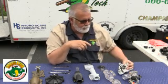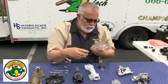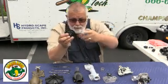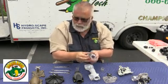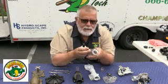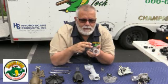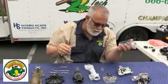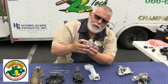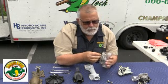Here's the clear body with the diaphragm. The solenoid normally goes here, the bonnet goes on, and this is the diaphragm with the little teeny hole right here. This diaphragm flips right inside. I'm normally going to use some O-ring lube — if I put a light amount of O-ring lube around here, it seals it and prolongs the diaphragm, making it last much, much longer. Then you have your spring on top, pop the bonnet on, snap it down, and put the screws in.